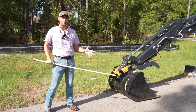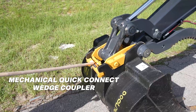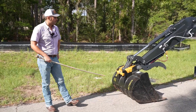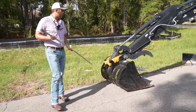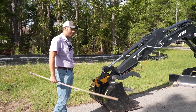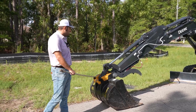All the John Deere mini excavators have this mechanical quick connect wedge coupler. There's one bolt right there, and whenever you loosen that bolt, you can drop the wedge and then roll out of your bucket. On a lot of other excavators, you have to knock pins out of the bucket in order to change it — you don't have to do that on our excavators. It's one bolt right here and you can drop it.